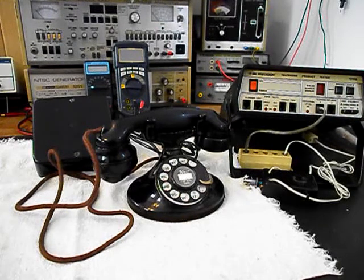And we want to go through the bell box and network. We want to make sure that everything is wired properly and that the bell is adjusted. We also want to go through the rotary dial. It is a little sluggish, so we're going to take a look at that issue. So we're going to go through the entire telephone and bell box while they're in the shop.